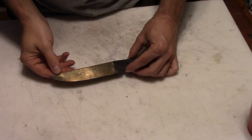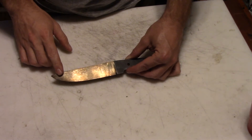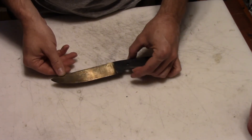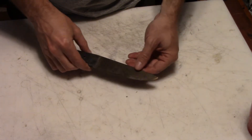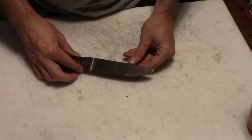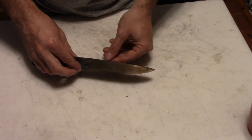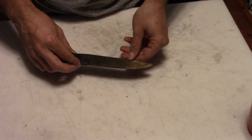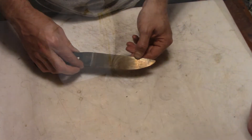It's been cleaned up a little bit on the blade and then it got tempered for a couple hours in the oven. You can see a little bit of that bronze color that came out for our temper color. Now we get to the part where it's just going to be a couple hours of hand sanding — nobody wants to watch two hours of somebody sitting there hand sanding, so we're just going to kind of gloss over that and y'all are just going to have to use your imagination.